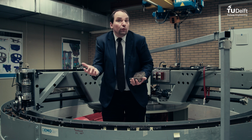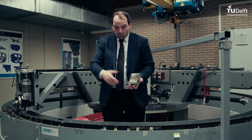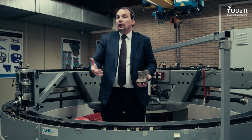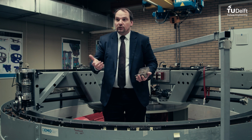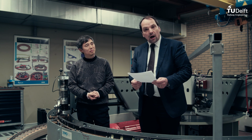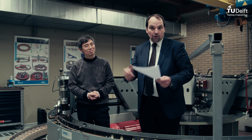And the best choice is, what do you like? It's always a compromise. Do you like wear, so you have to do welding and repair welding to repair the gauge corner, or turning off the wheels more rapidly or more frequently? Or do you like a harder rail and wheel, and then you get more problems of cracks in your wheel and on your rail? So it's always a devil's solution. What do you like? One of the students asked us, what is the right hardness of wheel or the rail? And is that the right combination? And what is the right recipe to get this in a good balance?